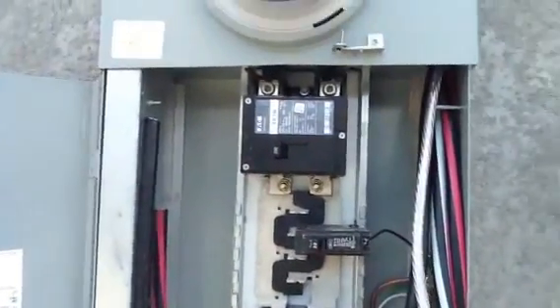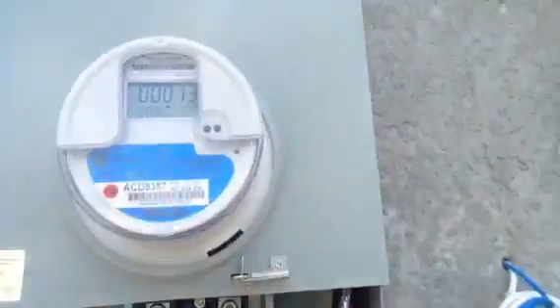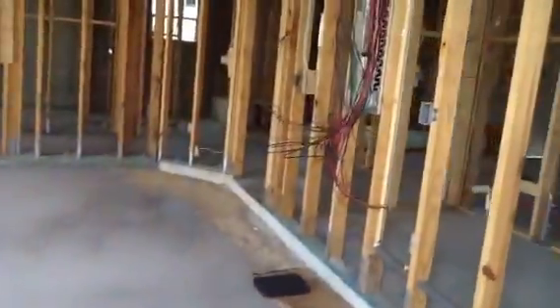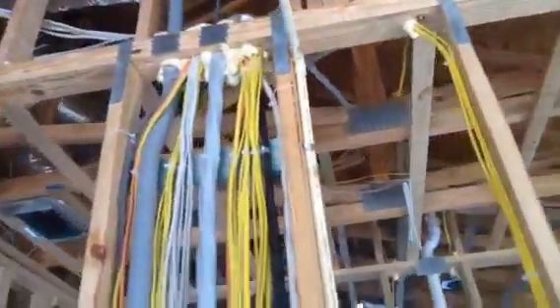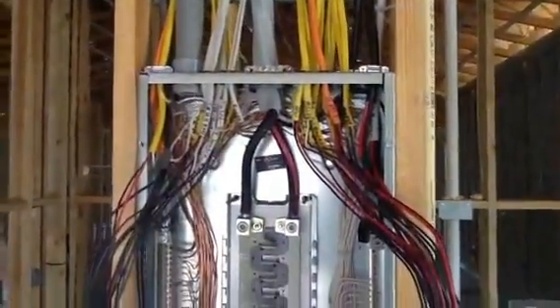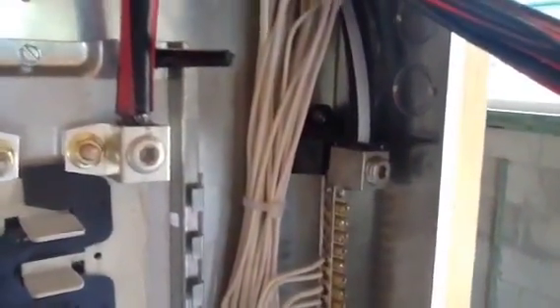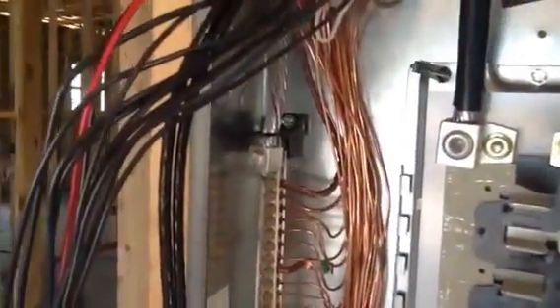That's a quick explanation of the outside service. Now I'm going to take this condo — I want you to follow this up here. Because this is not a back-to-back service, we have to put a four-wire system in, because we have a subpanel. Here's our subpanel — let me show you the wires coming in. You can see it coming overhead, right down into the top of this panel. Once again, there's your two main lugs, and then here is your neutral, your black wire with the white stripe, and here is your ground wire, the bare aluminum wire that's tied in.